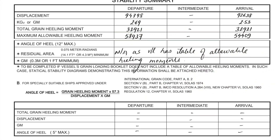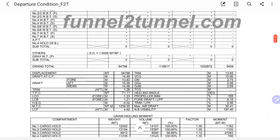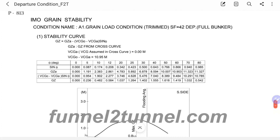I have mentioned the stability summary as well — the displacement of the ship, the arrival displacement, the GM, the total grain heeling moment, and the maximum allowable grain heeling moment. We have completed the NCP form across all four pages without much hassle. The only thing to ensure is entering the volumetric heeling moments, which can be easily calculated using the grain stability booklet — I have already covered that in my blog. Everything else can be filled very conveniently using the load indicator report. Filling up the NCP form is very convenient provided you have all the data handy.